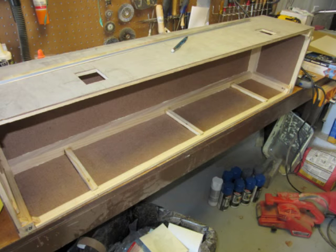The final bit of reinforcement that needs to be made is after locating where your hinges will be. I have three hinges on this case, but you know, you could use four. I would not use less than three for a large case. A smaller case can get by with two. Only a really big case needs four. Anyway, wherever the hinges are going to be, you need to reinforce it with